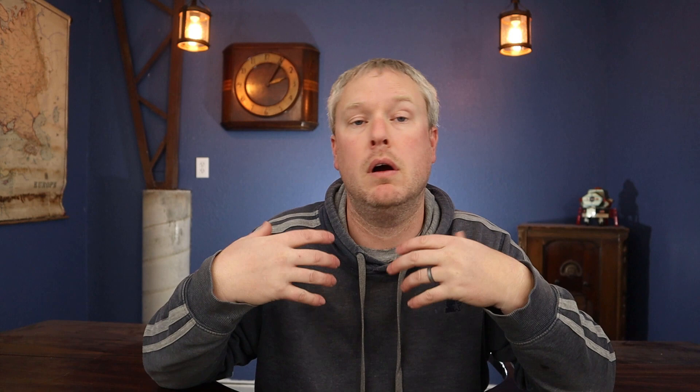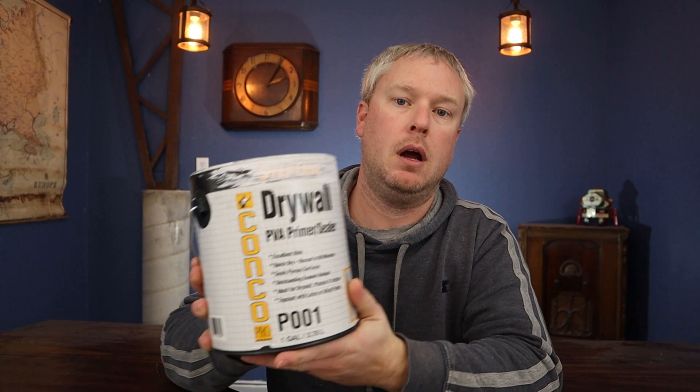All of the products I'm showing you are available at your home store, whether it's Lowe's, Menards, Home Depot, or even Ace. You can also get them from Amazon — I've left links in the description. Before you ever put any paint on your walls, you most likely did a little bit of wall repair. If you did and you have mud anywhere, you need to put some sort of a drywall primer on there — a PVA primer sealer. Always prime any repair you have done. Don't skip this step.